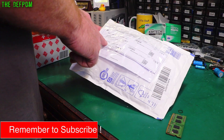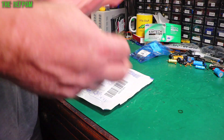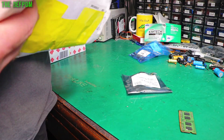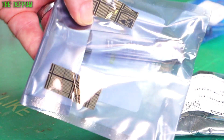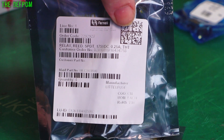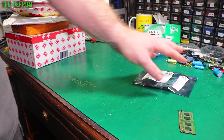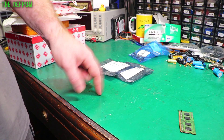So this one's got reed relays in it - single pole double throw relays. I purchased two different versions of the same relay; I think one's got an internal shield, one doesn't or something like that. These are for a repair I'm doing and also for stock. I'll have to revisit this and figure out exactly which parts I need to use because I've got so many parts. I actually thought I had the right ones already, but I didn't. The ones I had were the same footprint and the same package style, but the actual functionality of the pinout was different.